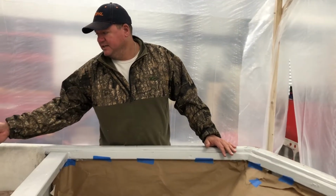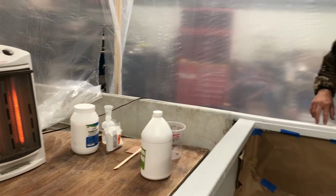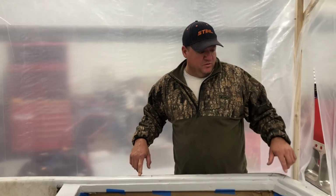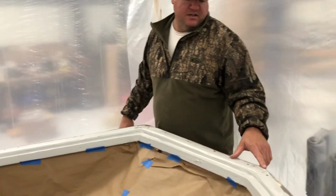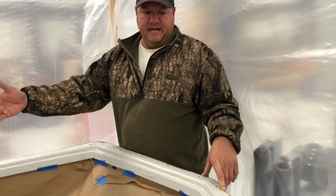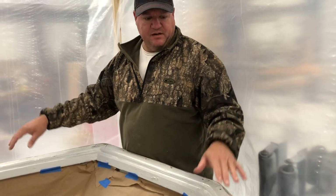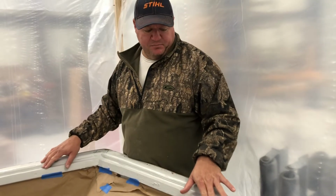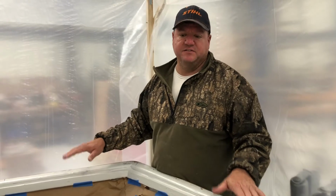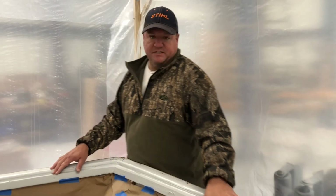And we're going to take this lid or this casting deck and we're going to flip it over and put it on top. I have reference marks on the side here. I don't know if you can see them or not, but they're here in the corners. There's some right here in the front. And the reason we do that is because it just makes it easier whenever you set the casting deck on top of here to position it in the right spot. So when we get ready to screw it down, once we have the fiberglass putty or peanut butter in place here, we'll screw it down and we'll know exactly where it needs to fit, so there's no guessing while that resin is starting to harden, and you won't get yourself in a bind.